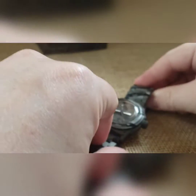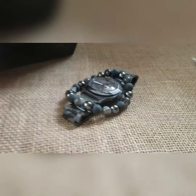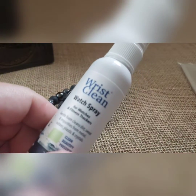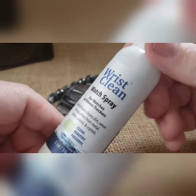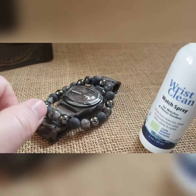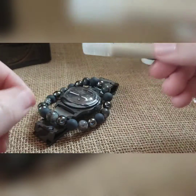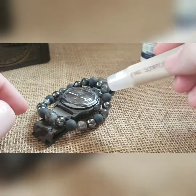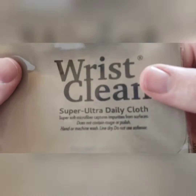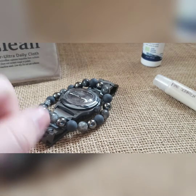That's the build — congrats, be stylish! It's going to come with matching beads and in a black Kraken box. It'll also come with watch cleaner — I'm out of the four-ounce with my logo so I have the two-ounce smaller size. This goes on all glass and metal parts. You're also going to have some fine scratch remover — this is Novus 2 from Amazon, just repackaged — for your acrylic glass. Put a tiny bit on, buff against the scratch using the included microfiber, and about 20–30 seconds later it will be completely fixed.